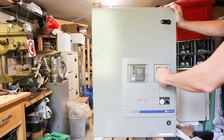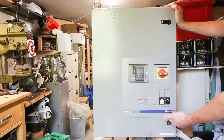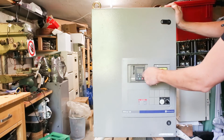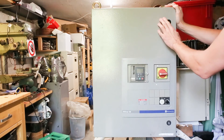Here at the front we have a large disconnector. We have what seems to be a manual speed dial on a potentiometer, some kind of on-off button, and auto seems to be missing. And then there is of course access to the normal control panel of the frequency drive. So let's see what's inside.